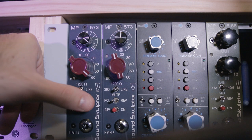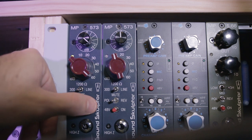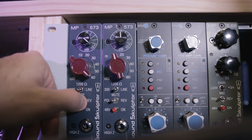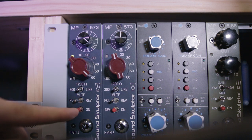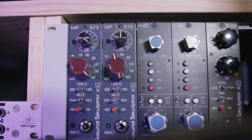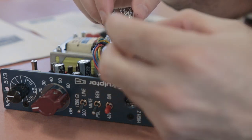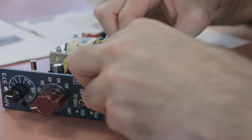Check the polarity switch — it should put the signal in opposite phase — then put it back. Basically check all those switches, then do the same thing with a condenser microphone and check that phantom power is working. Once you've confirmed correct signal, no weird phase issues, all switches and dials working, power off the 500 series rack and take the MP573 unit out.